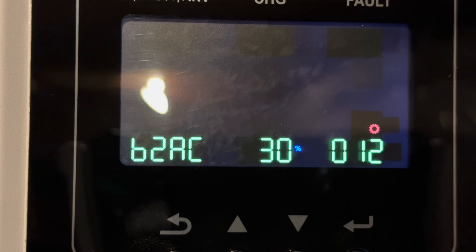Setting 12 is the percentage battery charge that will result in the inverters switching to grid to carry the loads from the battery. Our value is set to 30%. Setting 13 determines the charge of the battery that will take over the load from the grid when the battery is being charged. So if the battery is being charged up to 45%, once it hits 45%, it will start carrying the loads. Generally, the solar charges up to 45%, starts carrying the loads of the house, and then continues charging.